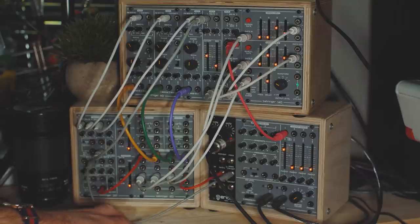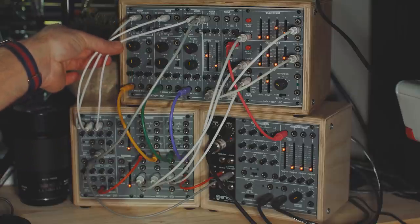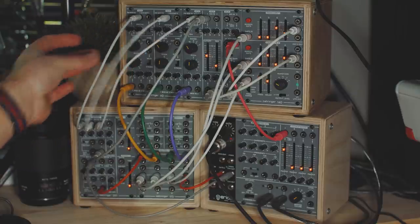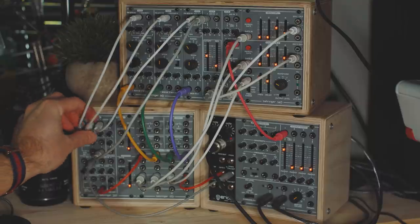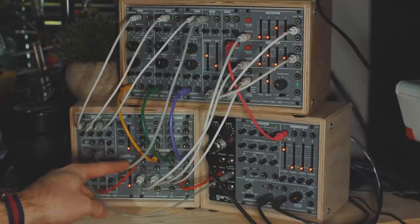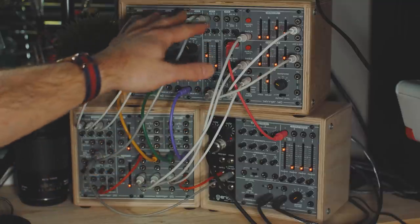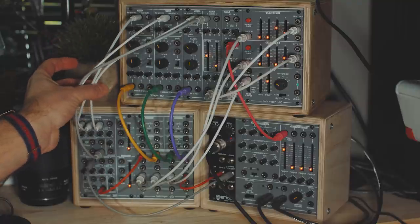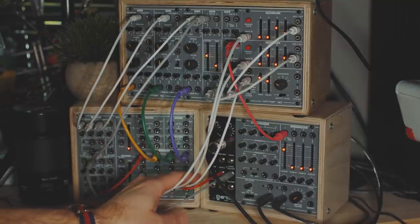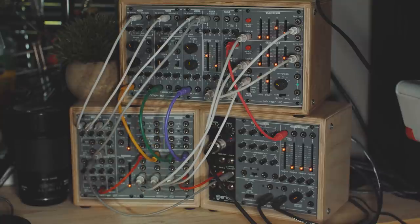And in terms of the audio output from those oscillators, I'm taking all 3 of those audio outs going into a mixer and using it as a real mixer this time, setting the levels how I want, and then I've got an output from that mixer going into my filter. So that's my audio routing worked out with these 3 oscillators, and that's my CV inputs with the 3 oscillators. What else have I got going on here with this patch?